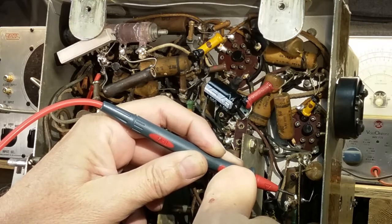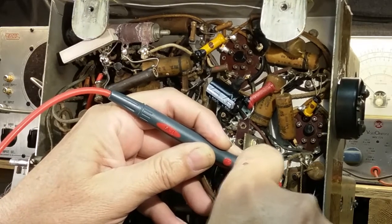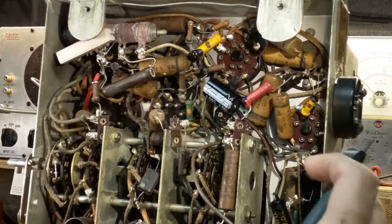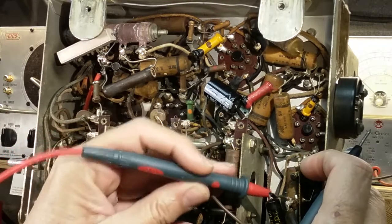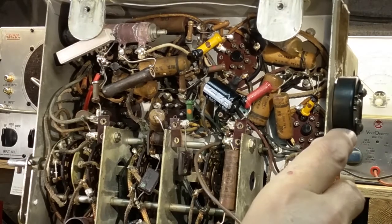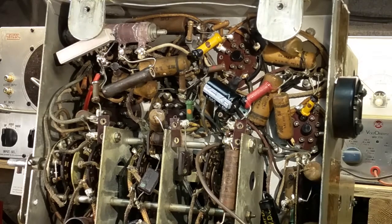100K. It would be something, right? I'm getting a reading on it though. Alright, it's across the capacitor. Yeah, let's stop. 53.8. Body's green, that's 5. Orange, that should be 5K. Try it one more time. 53K. What am I doing now? It's not yellow. Orange, so it's 3 zeros, 4 zeros. 50K. Yep, okay, it's fine. It's a little out of tolerance. I see. Okay. Well, that takes us to the coils.